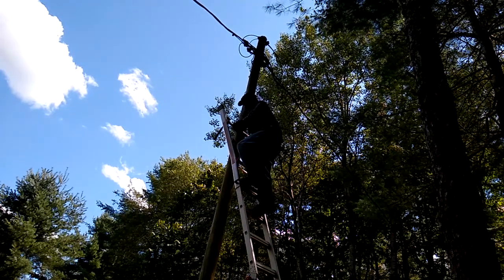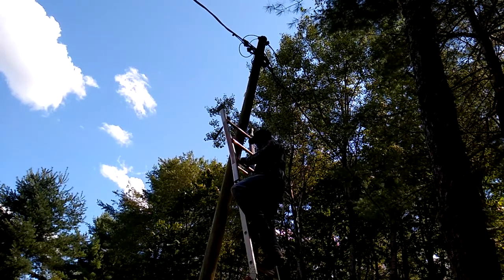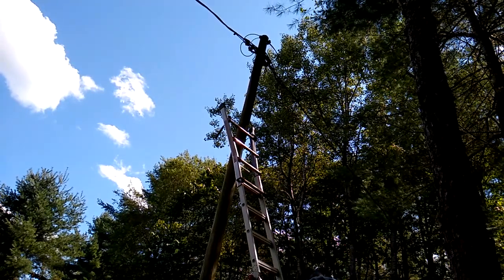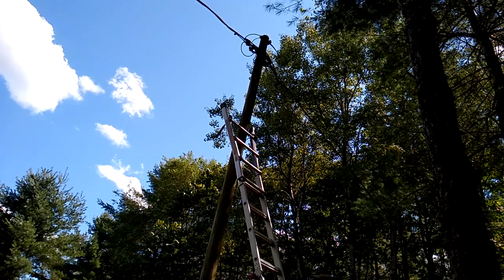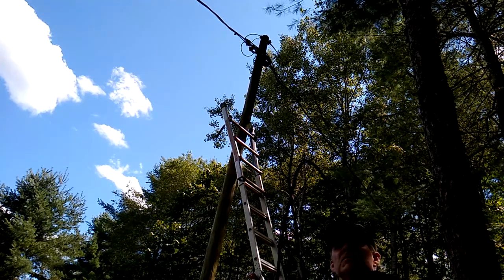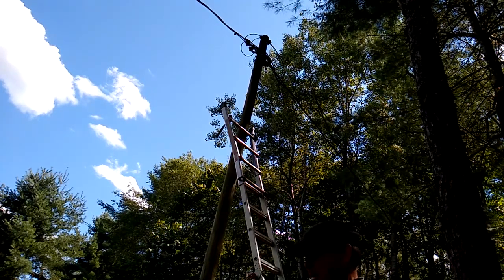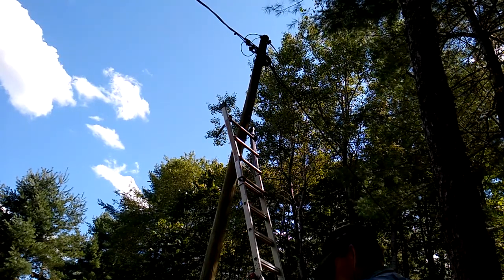Bring the guy wire down, bend a new loop on the end here. This stuff is just too heavy duty to try to bend with any tension on it. As you can see, that loop has got to be moved probably at least, oh, I don't know, I'm going to go with probably 3 inches. That way I can make up the slack with the eye bolt tightening up.